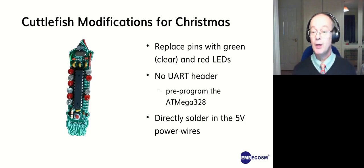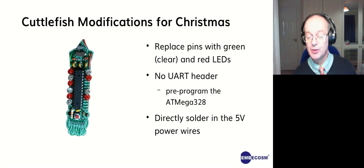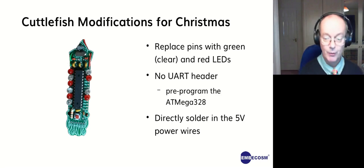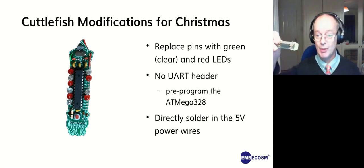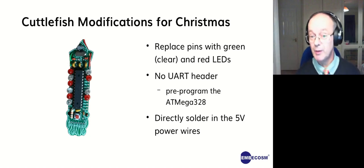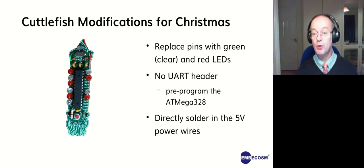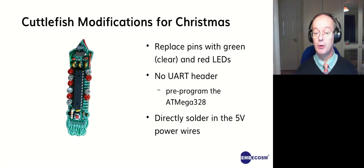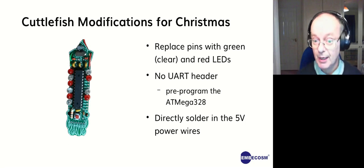So we modified the cuttlefish. We didn't want lots of circuit boards and everything, so it was, you know, breadboards to plug it in. So instead of having pins to plug this in the breadboard, and just to show you, we do have them, there's one I've got sitting on my desk, we thought we'll solder the LEDs directly on. We don't want a programming header. We're not going to program it on the fly. We'll pre-program the chips and push them in the socket,